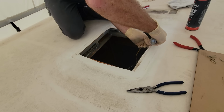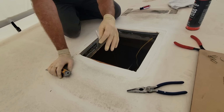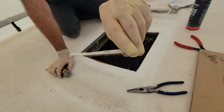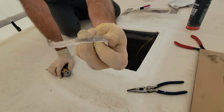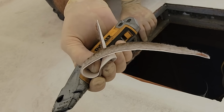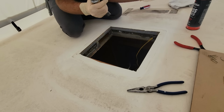I even have this extra flap there. There's texture on it, and this is a felt-backed or fleece-backed TPO, so it's not a rubber roof. It is a membrane roof, but this is TPO with a felt or fleece backing on it. That's why it has fiber on it. Harder roofs to replace because that felt doesn't like to come off. It does make it very durable, so it doesn't tear so easily.